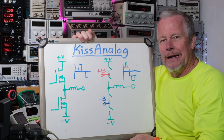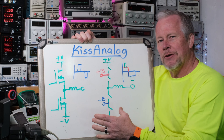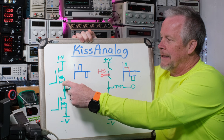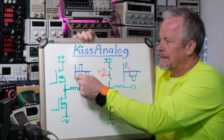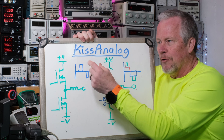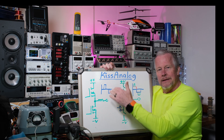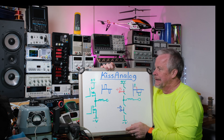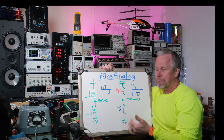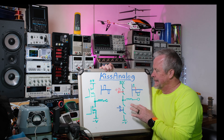It's not very pretty — we'll look at it on the scope in a moment. Compared to a pure sine wave: the transistor pulses at the beginning of the sine wave with very narrow pulse widths, then goes wider towards the top of the waveform, then back to narrow as it crosses zero, and the inductor smooths it out into a sine wave. It's a lot like a class D amplifier — a pure sine wave inverter and a class D amplifier have a lot in common.